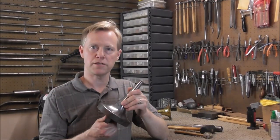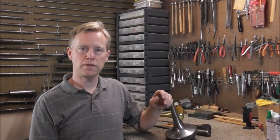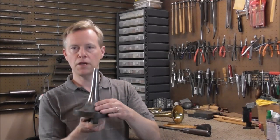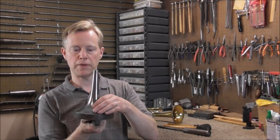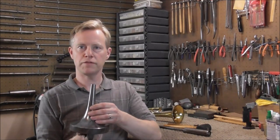This tool is not used by itself — it is used in conjunction with other tools. You may think that since this is shaped like a trumpet bell, you can take any trumpet bell and put it on there and just hit it with a hammer, and then the dents will come out. But it's usually not quite that easy. One reason is that this does not match up exactly to a trumpet bell, and even though trumpet bells look a lot alike, they are slightly different in the taper of the flare and the diameter of the tubing.